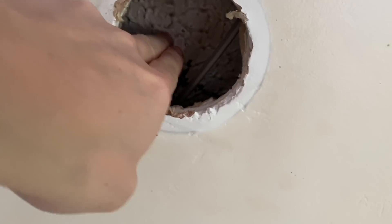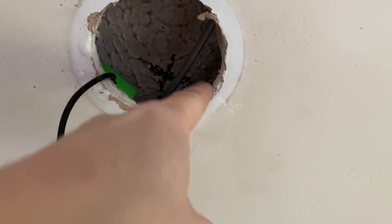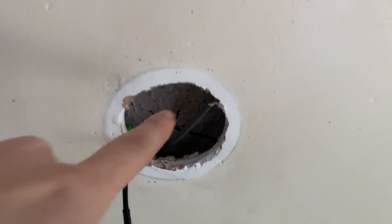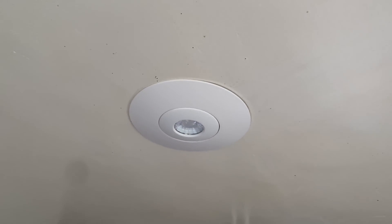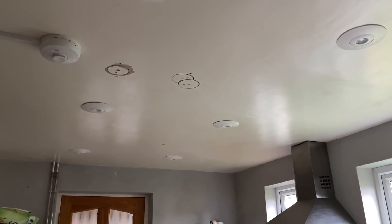Because the ceiling was really shallow — about five centimetres — and it's actually concrete up there, there's no way we can drill that out. What I've had to do is put smaller downlights in, which are slightly smaller than these holes. I've been using JCC 1001s with the converter plates so the cowl expands and covers the hole nice and neatly. That was the only solution I could come up with. I'm just going to do the junction box now and then I've got a couple of holes to fill in.